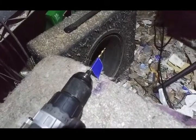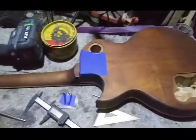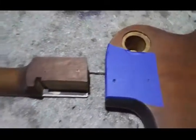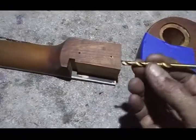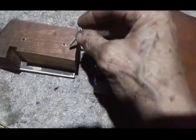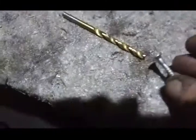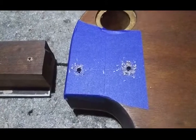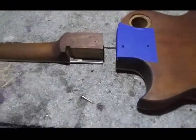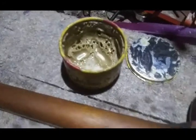Okay, that's the smaller of the two drill bits — this one goes all the way through to the tape mark on both holes. That's set all the way through. Now for the bigger one: it only goes through the body holes, not the neck holes, which are already set for the thread size. We need to enlarge the body holes for the screw shank clearance. There we go, just opened them out to that larger size. Get the wax out and it's time to screw it together.